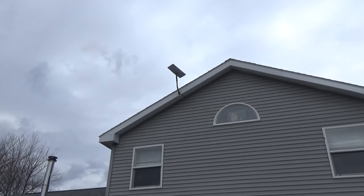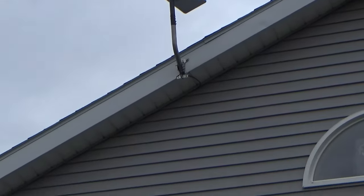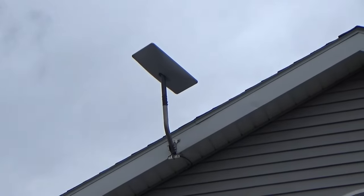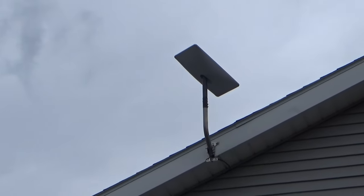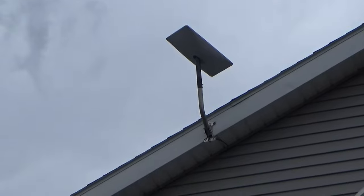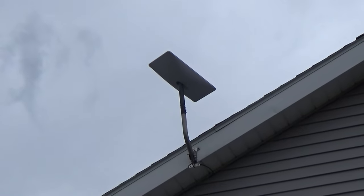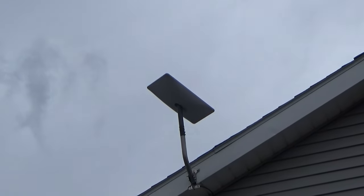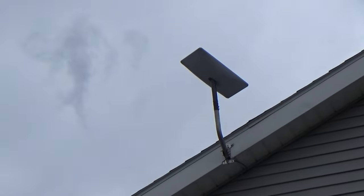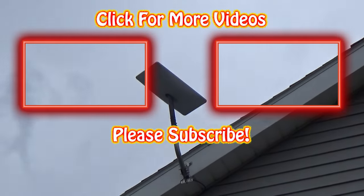We're done and I think it came out pretty well. I was able to get three lag bolts in, it's up there sturdy, and I was able to hide the cable really well — I don't even think you can see it, maybe in the corners that'd be about it. This is a good alternative to the Starlink mounts — it gets me up above the roof and I'm quite certain I'm clearing the peak. If you want to check out this mount, I've got a link down below. Please leave questions and comments below as well — I'll probably post more Starlink videos as I learn more. If you've got tips or tricks about your Starlink, leave those below too. If you're not a subscriber and want to see more of this type of content, hit that subscribe button. Thanks for watching and take care.